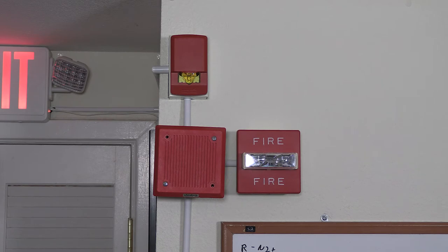There are terminals for each of those tones, so there's a potential of six wires that can be put into the back of the alarm to control each of the different outputs — meaning that there are three pairs, positive and negative, for each of the tones, and then of course a basic high/low volume selector, for which we are going to select low because this alarm is very loud.